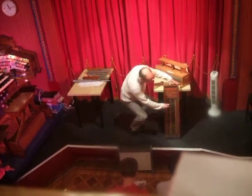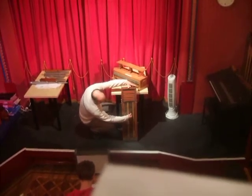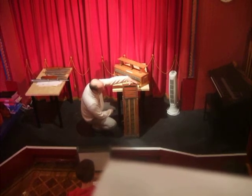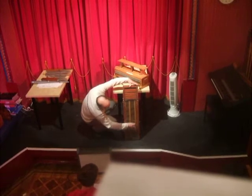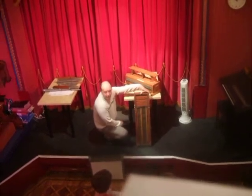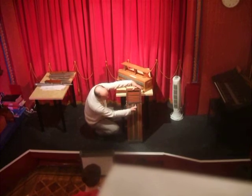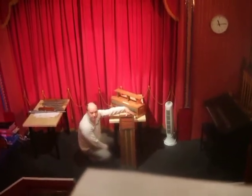What we have is a bus bar for each note of the pipes and a little finger contact for each note on the keyboard. On activating the stop, this bakelite rod inside gets pulled up and the contacts make. When the contact is made on the key, the small finger contact is made live, puts 12 volts onto the bus bar, and the pipe will sound.